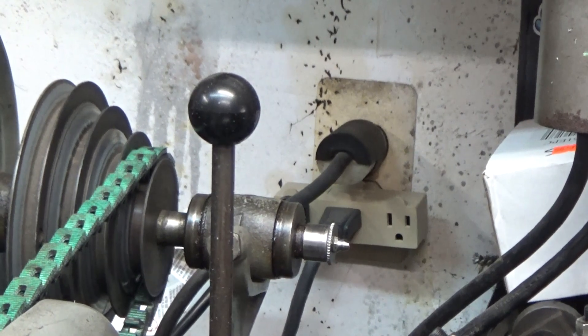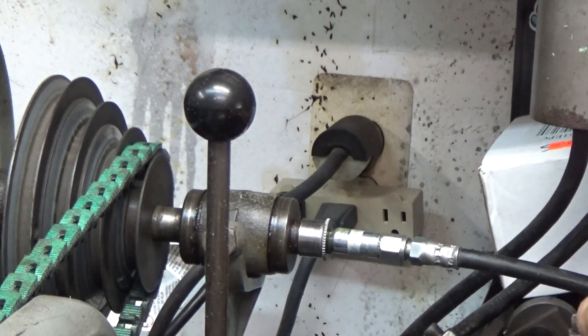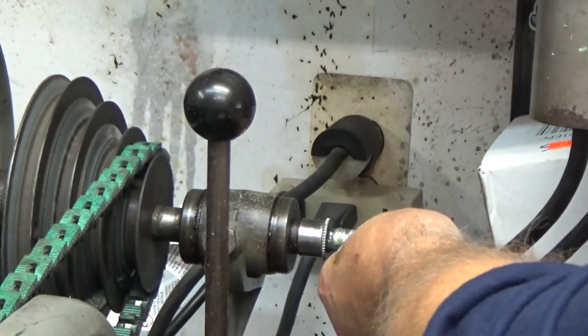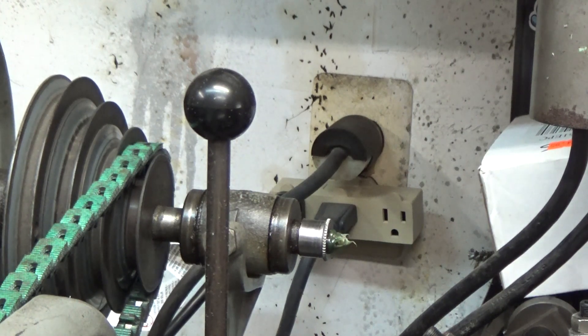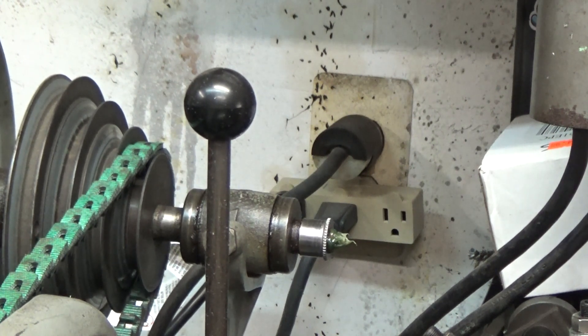Okay, it's all ready. I'm going to put some grease in it — a few pumps. It's actually starting to come out the other side around the bushings, because that shaft is hollow. Let me put it on this side, give it a few pumps, and that'll do it. Every couple of times you use the lathe, you give it a pump or two and you're set.